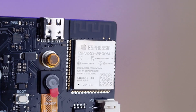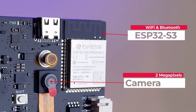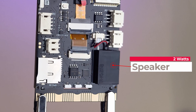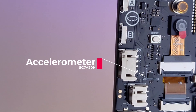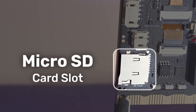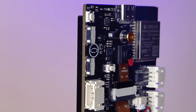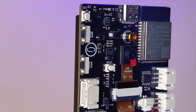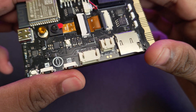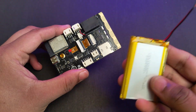And in the back, the built-in ESP32 provides Wi-Fi and Bluetooth, a 2-megapixel camera, a 2-watt speaker, an accelerometer, 3 RGB LED lights, and a microSD card slot. It also has two programmable buttons, and the boot and reset button of the ESP32 is also accessible. It also has a battery connector for LiPo batteries, but no protection circuits, so use batteries with built-in protection.